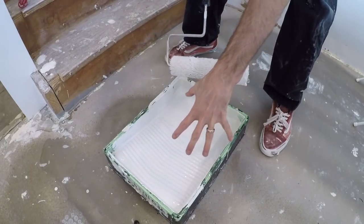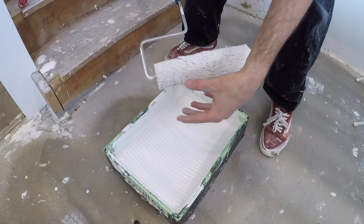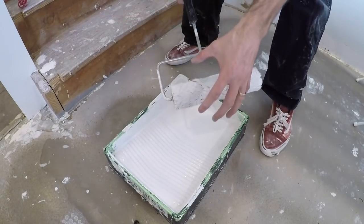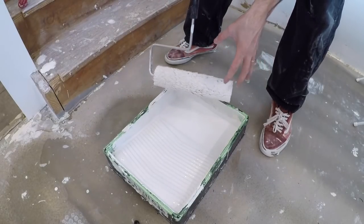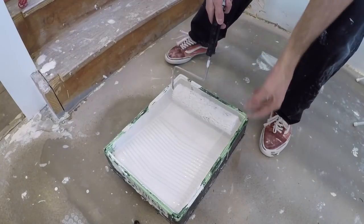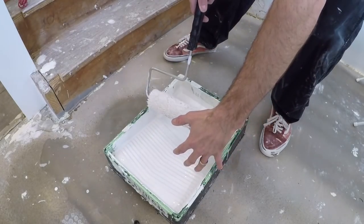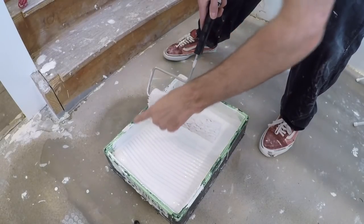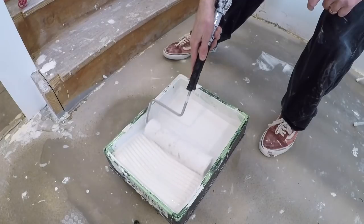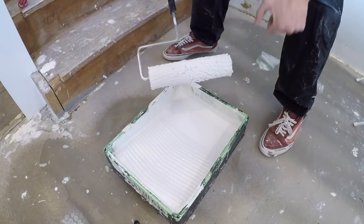This is the same method you can use to paint different colors on each wall. Before I do one of those skinny corners, I'm going to show you how to load the roller. Right now I've got a little bit of paint on this roller — not too much. Instead of dipping into the deepest part and pushing all that stuff up, I'm only going to go back to this part and just get a little bit of paint. Knowing how much paint you have on your roller and how far it's going to go is one of the keys.